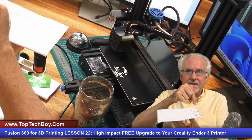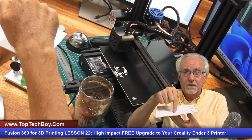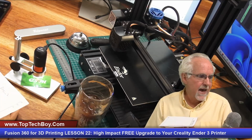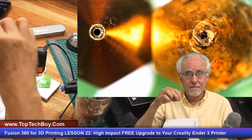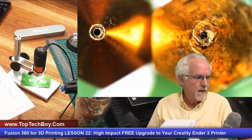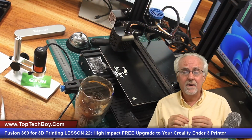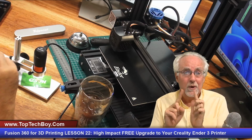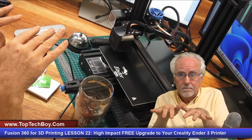Well, one is as you're dragging your print nozzle over to the point that you're going to print, you're actually rubbing it across the bed, and that can make this be a problem where you're actually damaging the nozzle as you are scooting across the bed, dragging it. And then the second problem is that this only really allows us to print small things kind of in that sweet spot in the middle of the bed that we have got the alignment properly for.